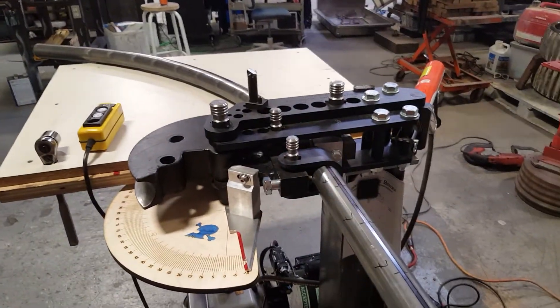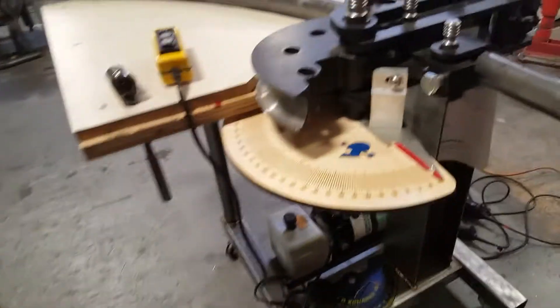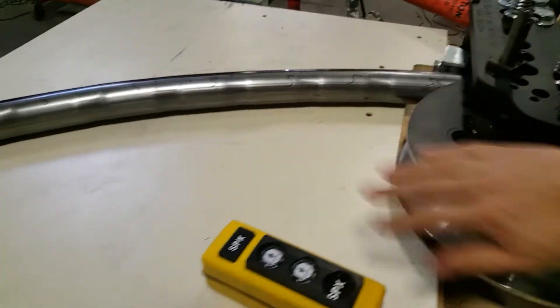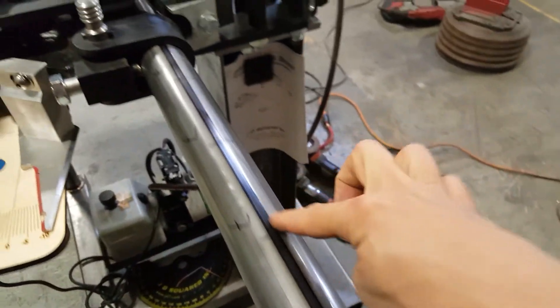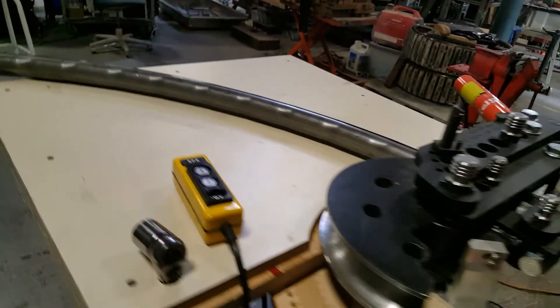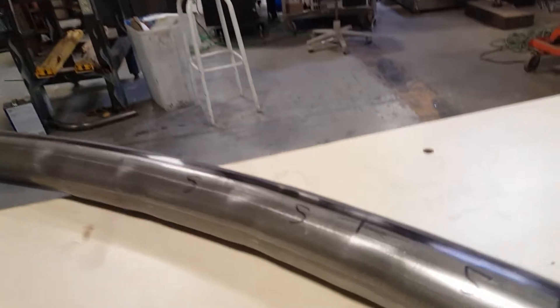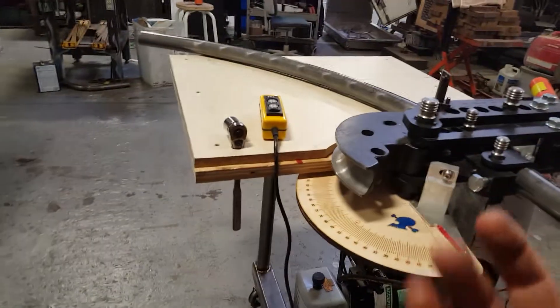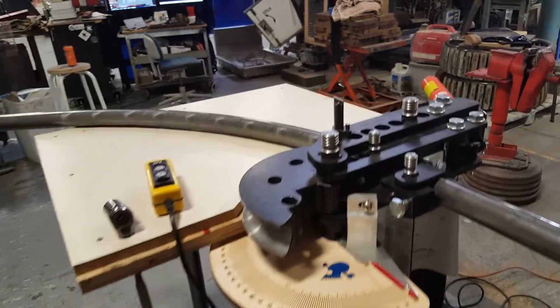Forgive me, I'm just getting over a cold so my voice is a little rough. I've got this JD Square hydraulic tube bender — it's got a hydraulic ram, a little pump down there, and this big die that wraps the tube around it. This one's in the process of being bent right now. I've got little marks every four inches that I can line up, and the numbers written on there are how many degrees for each little bend — five degrees here, seven at the end. If it were the same degrees per bend all the way through it would be a circle, but since we're making ellipses it changes as you move throughout.